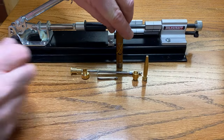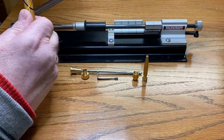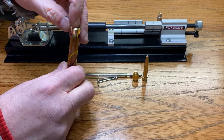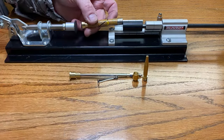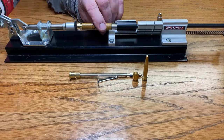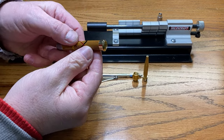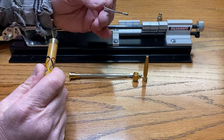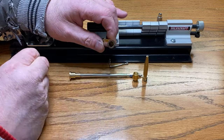I'm ready to press this blank into the kit. I think we're going to press the cap in first, so we'll pull this bushing out. Place our cap coupler into the back of the blank. I'm going to flip this around so that it's against the rubber grommet. Very nice — I like it a lot. But I did not put the clip on here, so let me get a punch, I'm going to knock this out, then we're going to repress it with the clip.